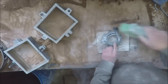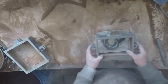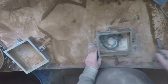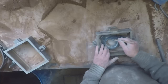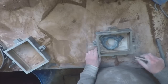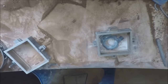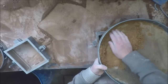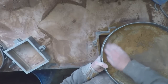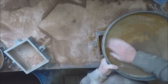A little bit of parting on it first. This is quite tight in the box - quite tight indeed. That's probably not too bad for a position about there. A fair amount of fine facing sand to try and cover it all over - it's a fairly high pattern of course, so it's going to take a fair bit of this to cover it. Close enough.